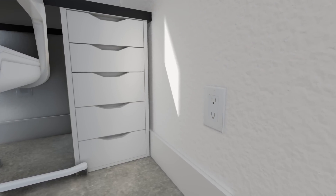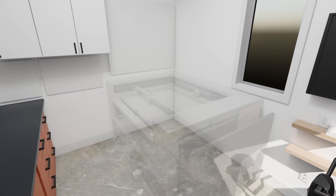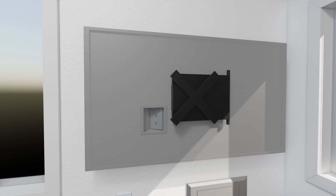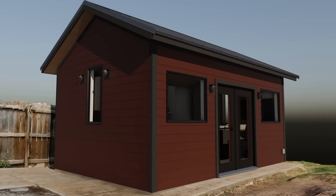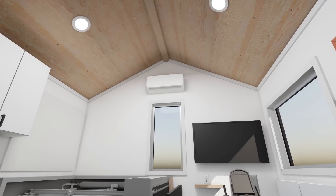Once I had this plan I could work backwards and make sure I had outlets placed conveniently for the electronics I'd have. Near the laser cutter I'm going to have two outlets that are each on their own 20 amp circuit — one will power the laser cutter itself and the second might be useful for secondary equipment like the ventilation system and air compressor. For the TV I'll have an outlet up on the wall near the mounting bracket so I can keep wires hidden. The rest of the interior outlets are somewhat evenly spaced around the room so from any spot along the wall you'll never be more than three feet from an outlet. For lighting I'll have four can lights up on the ceiling and on the exterior I'll have four lights as shown. We'll also place a GFCI outlet out here on the front of the shop.